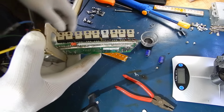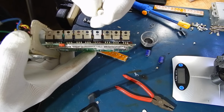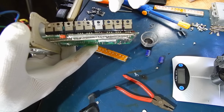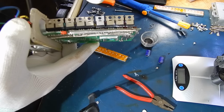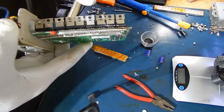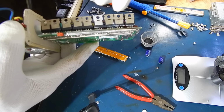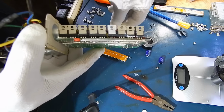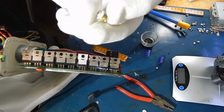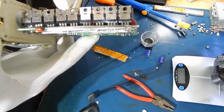That's a good tip. Another good tip is these little standoffs here. There are two types, nylon and plastic. The plastic ones, you can tell by looking at them, they're sort of like a clearish white. Make sure you don't over tighten them, because what happens is they squish and the screw will short the FET to the spreader bar. So that's bad. Make sure these ones here are all nylon, so they're good. So always check that, and also check your gapping.